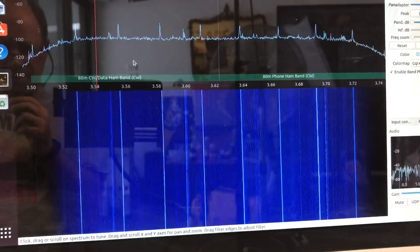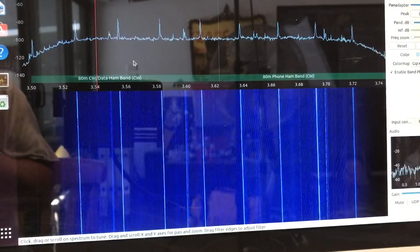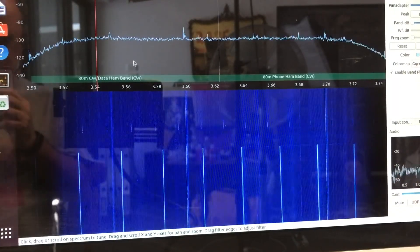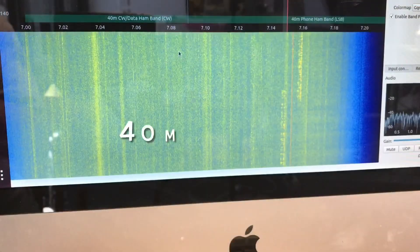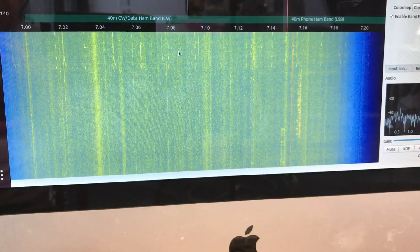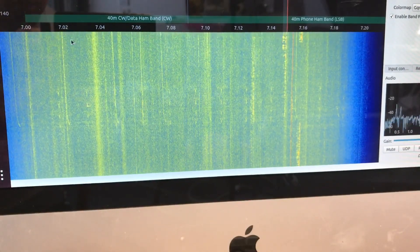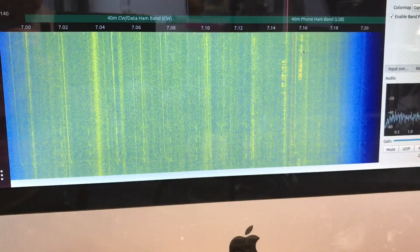This is 3.5 megs and there is a ton of crud being generated — this is with the power supply on. And that's with the power supply off. So on 3.5 megs there is very pronounced rubbish being generated. We've just switched the supply back on and you can see quite a bit of RF being generated across the waterfall.